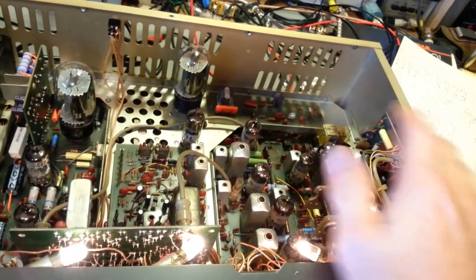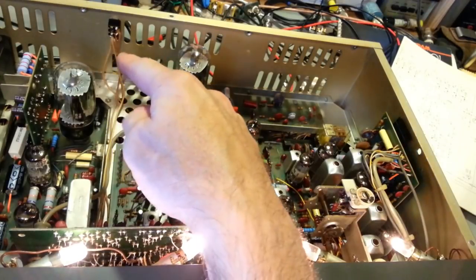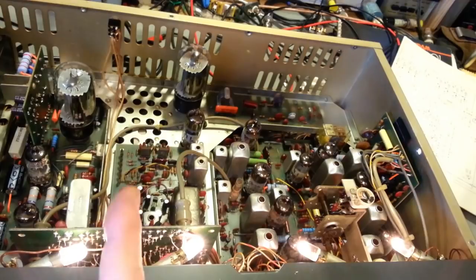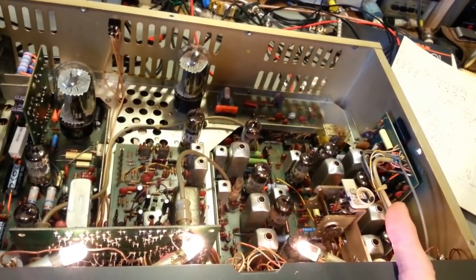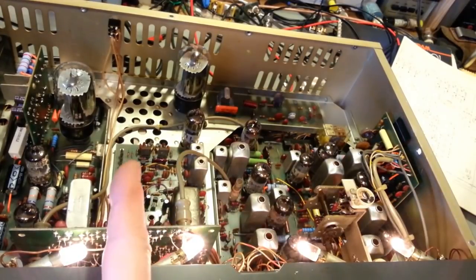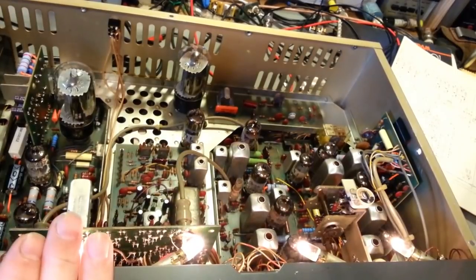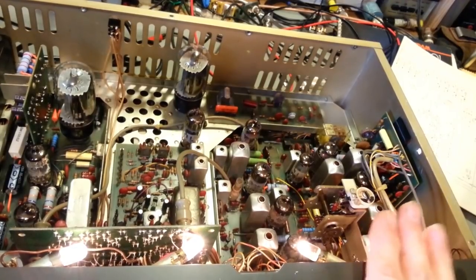With a radio like this, however, having that switch or not, normally it's just hardwired. It's not selectable. But by having that switch there, by being able to lock the transmit, or make the VFO control the transmit frequency as well, you really only need one crystal here. That's the one that should be set to channel 9 when you're using the VFO for your transmit frequency, or actually for anything, for receive as well. As long as you can get the channel 9 frequency output from this correct, then it doesn't matter. All the other crystals could be bad. Matter of fact, you could remove the rest of the crystals. They don't even need to be there, but you would only then be able to use the VFO.